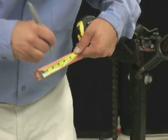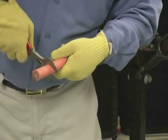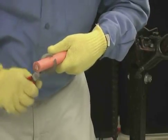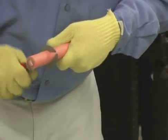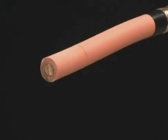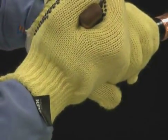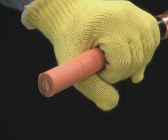Make a mark and work on the insulation at the desired dimension. Make a ring cut less than 90% of the way through the insulation with the ringing tool. The ringing tool needs only to be rotated by quarter turns — you do not need to rotate the tool 360 degrees around the insulation. Make two longitudinal cuts one half inch apart, less than 90% through the insulation.